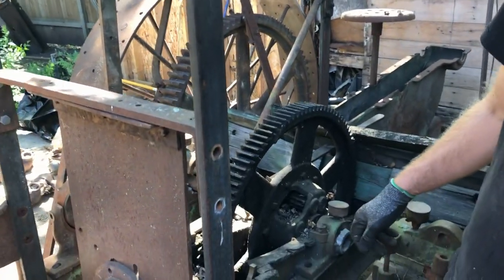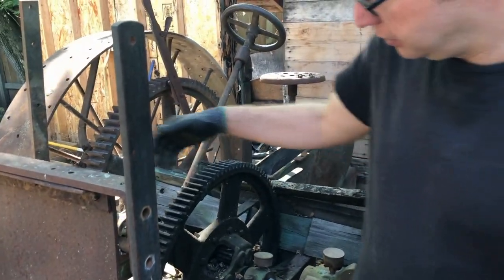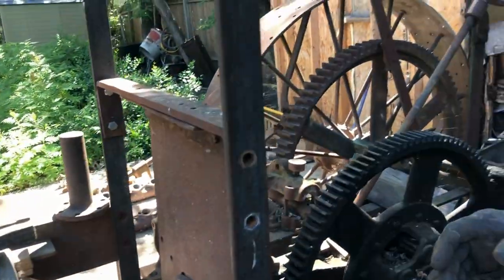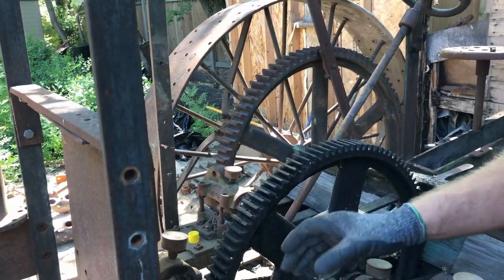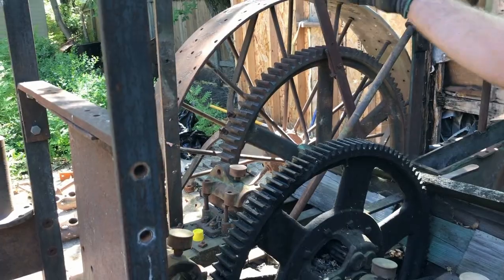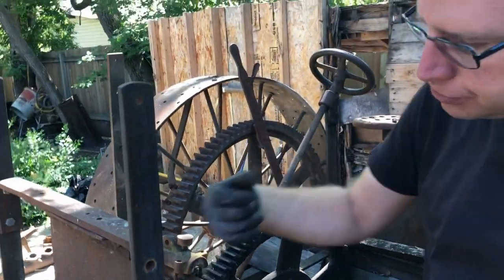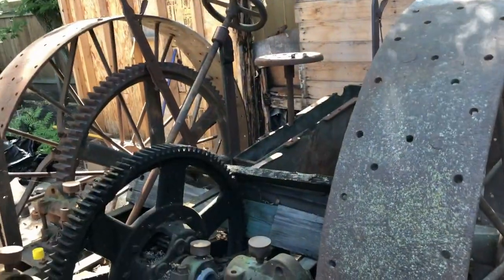It's a unique tractor, no transmission. They've got a plate in the back there, but basically the 2 plates sit here. You have the flywheel, which is just sitting underneath here at the moment. It has kind of like masonite, I guess, a friction material. It runs against there and turns your differential, which in turn turns your bevel gear and turns your rear wheels. To change speeds on it, there is no transmission. You just move your engine backwards and forward. I'll get up on the tractor here and show how that works.